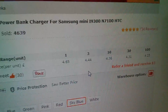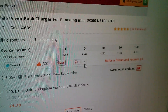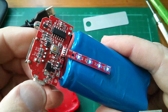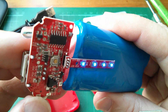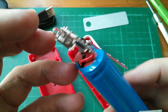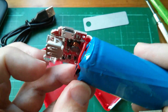The Banggood website's pretty slow. So £4.65 — there is a little bit of postage but typically not much. It put up a little bit of a fight but frankly not much. So there's a little daughter board, the strip with the four LEDs that flash the percentage charge level. On the main board you've got all the usual suspects: a microcontroller, an 8205 battery protection IC, and on the other side a DW01 which does the logic of the battery protection. There's an inductor there — you can just see the windings. USB out has the four-resistor Apple-style network to indicate two amps.